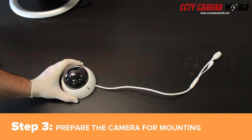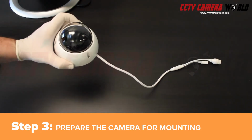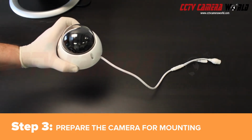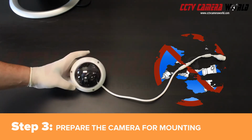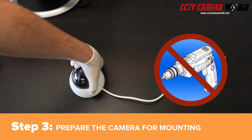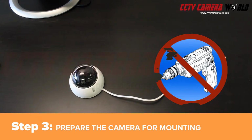The mounting holes for our dome cameras are within the housing. This helps to keep would-be thieves from removing the camera from its mounting location. So we're going to take the dome cover off. There are recessed screws in 3 locations, here, here, and here. In order to loosen them, you'll need the hex key that came with the camera.